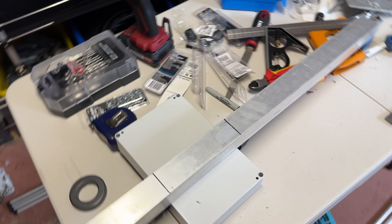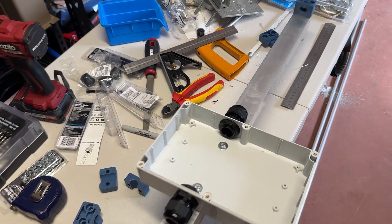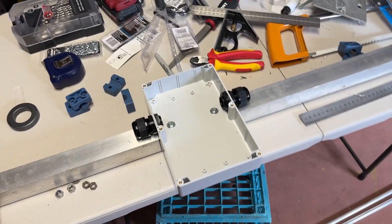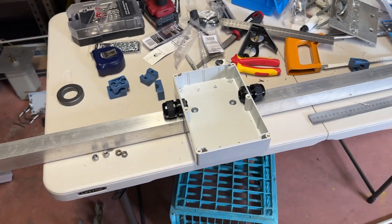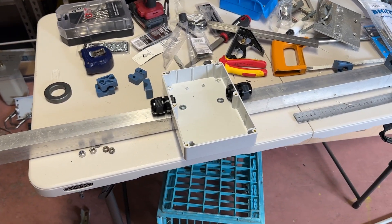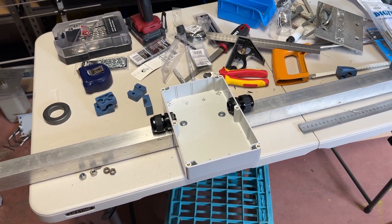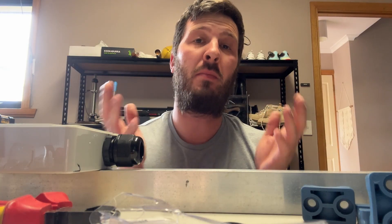Spacing it out from the tower also plays a little bit with the tuning, because a dipole antenna is typically about 72 ohms at the feed point — which is more than fine for what we want. But if you do mess around with the spacing out from the tower you can get it down to almost 50 ohms. It's going to be a little bit of experimentation, but I'm hoping it works quite well.